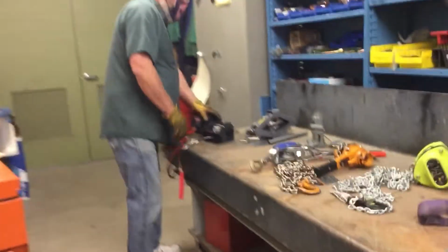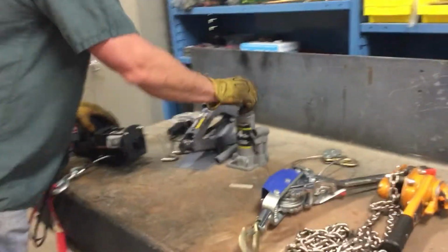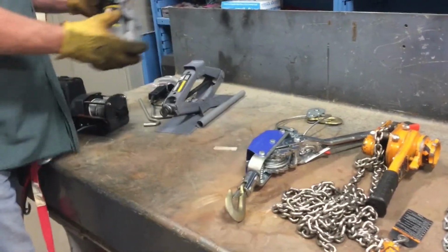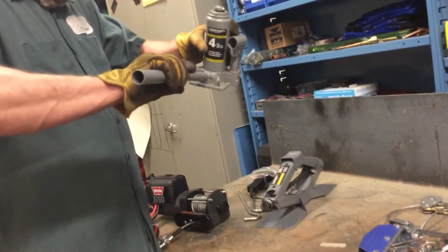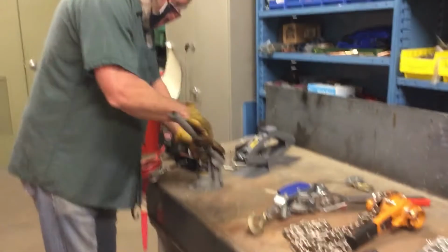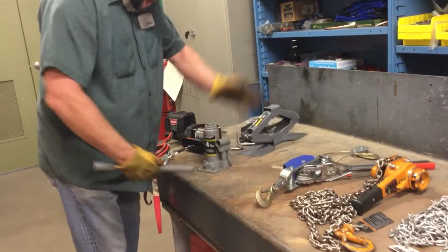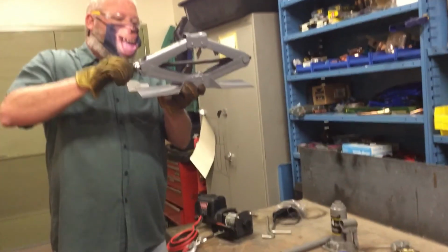The last couple items here, we have the hydraulic jack, used to lift things vertically. We inspect the screw. We inspect the base, make sure there's no cracks, no gouges, nothing uneven. Look at the bottom of the base. Make sure that this little screw screws in and out, because that's how we release and lock it to go up and down. Seems to work. Jack passes inspection. The second jack is a screw jack, given the name because it screws in and out to raise up and down.